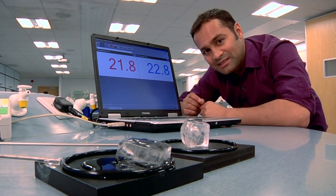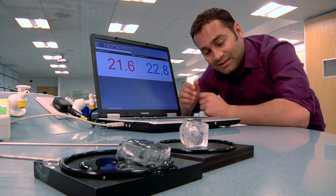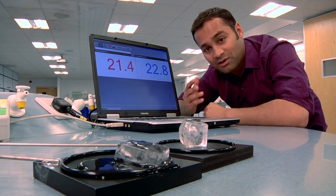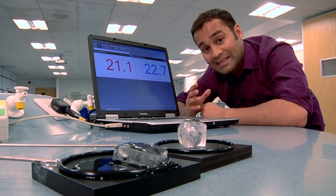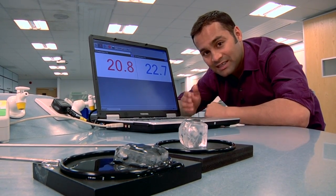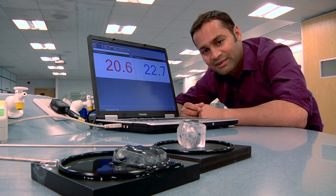The explanation is that the aluminium is a better conductor than the plastic, and so the heat transfer from the aluminium to the ice block is far more efficient. Heat from the block itself is being conducted into the ice and that's what makes it melt. The plastic, on the other hand, is a rather poor conductor and very little heat from the block itself is being transferred to the ice, so the ice sits there pretty much doing nothing.